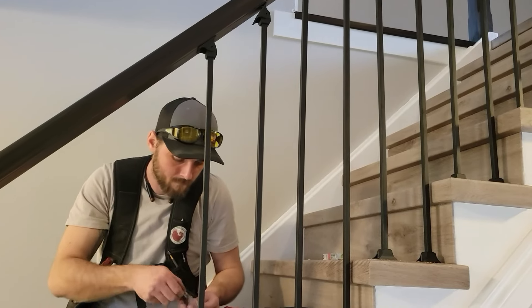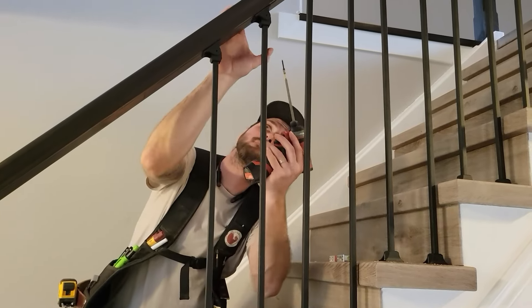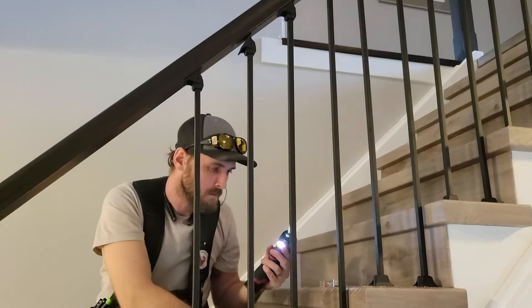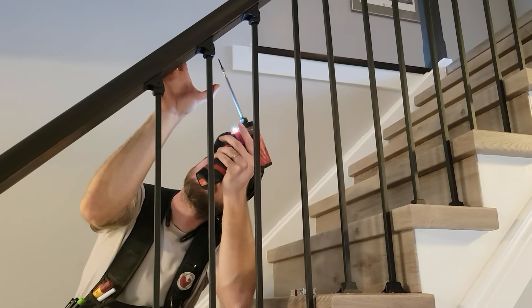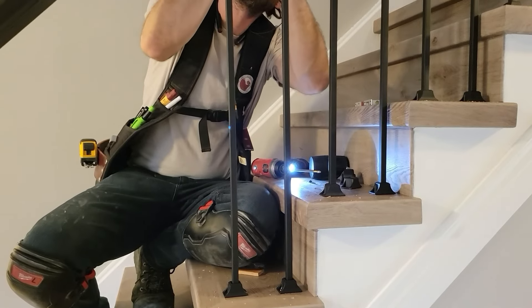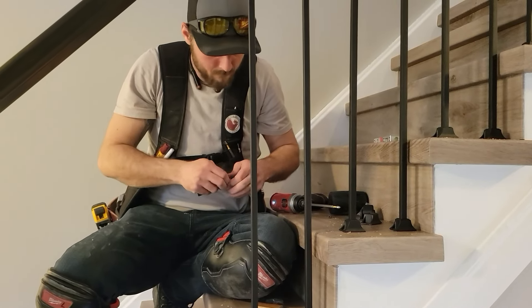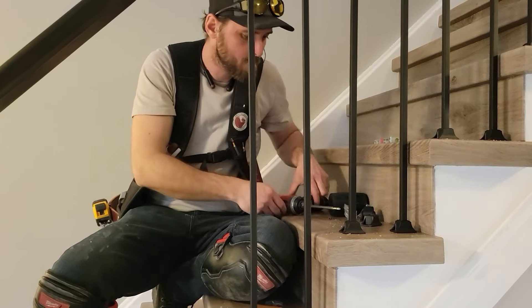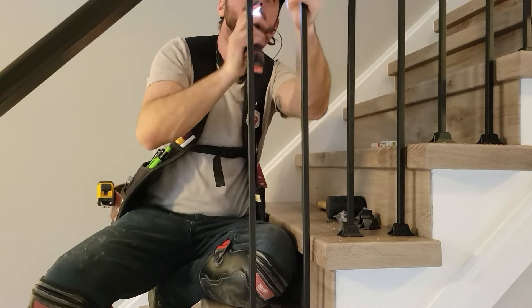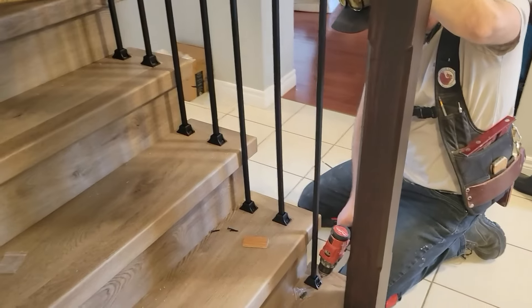Just to clarify that wiggle room — what we're mentioning is if you've tapped on the shoes and it's going to be very slightly shorter than you need to get it into place. When he is screwing this in, that shoe — because the bottom is in place — is obviously going to be pulled tight to that railing, so it may pull back slightly on that metal to make sure everything is firm and in place. We're not saying you would manually be pulling that shoe backwards — it's during the installation process. If the baluster itself is too short, when you go to do that screwing it's going to pull it completely off. It's not a lot, but there is that little bit that just puts everything nice and tight. There is that little bit of space to put it into place and then as we screw it, it's tightening everything up to give us a really beautiful finish.